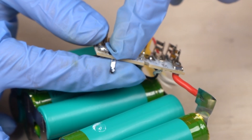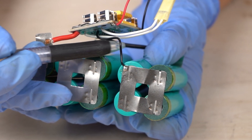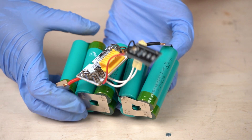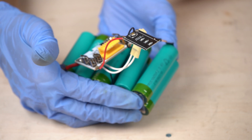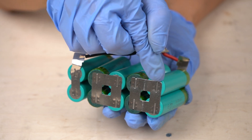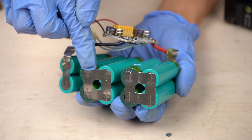There is another temperature sensor on the other side of the board. As for voltage monitoring, I found that the battery voltage of each cell is not monitored individually. This thin wire connected to the board is soldered to the spot-welded tab — it monitors only the two cells connected in parallel at that point. The other cells are not monitored individually. The only other voltage monitored is the combined voltage of all cells. The voltage of the remaining four series of batteries is not individually monitored — only the combined voltage is monitored.